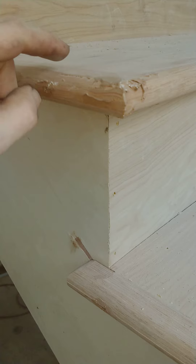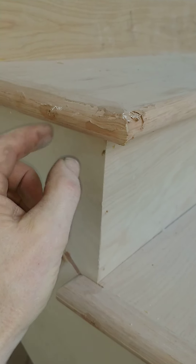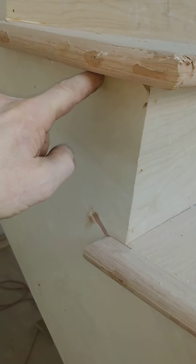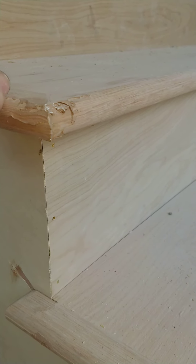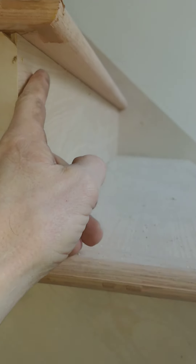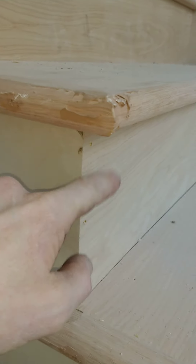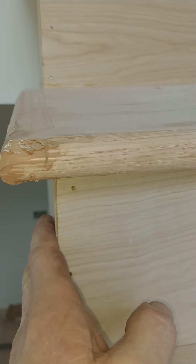The spindle had a dovetail shape - narrow at top and then wider at the bottom, flush with the bottom of the stair tread. They would slide the spindle in right here - one would be flush with the end of the tread, and also flush with the side of the stringer.